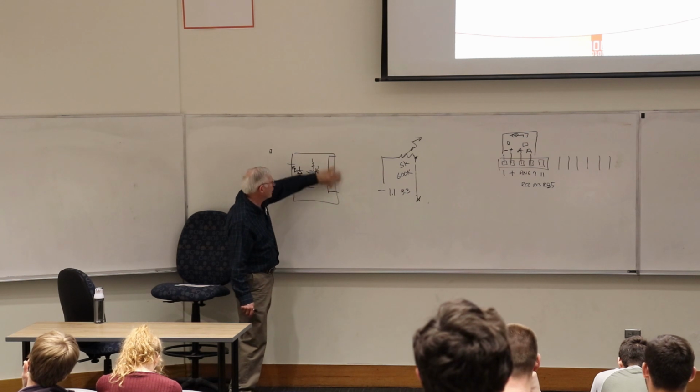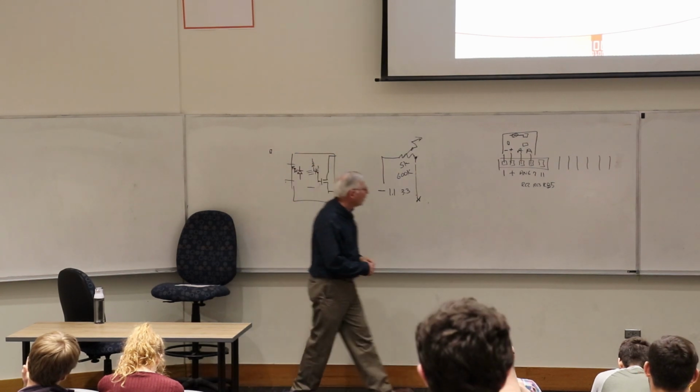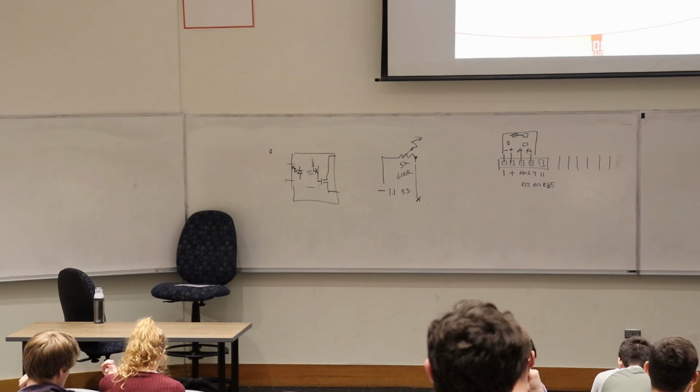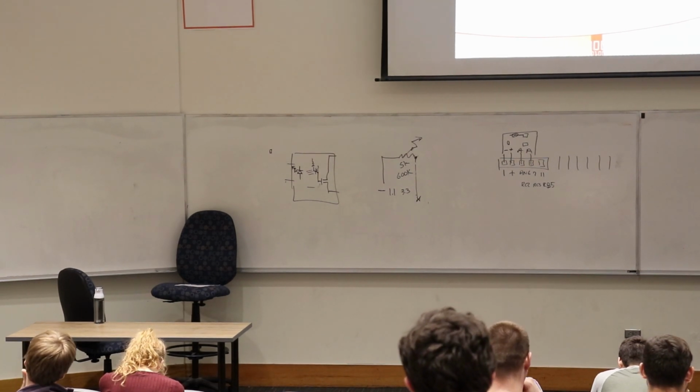The amount of current that it can handle on this end is, of course, driven by what kind of FET or BJTs are used and how that's hooked up, and we'll talk about that in a minute. But so often we do this opto-isolation to create this nice air gap between our low voltage circuits and our high voltage circuits.